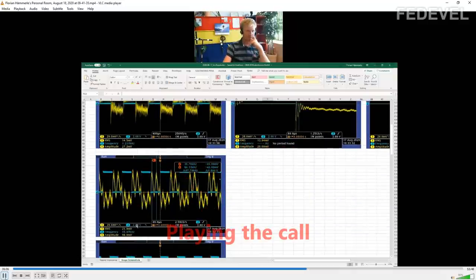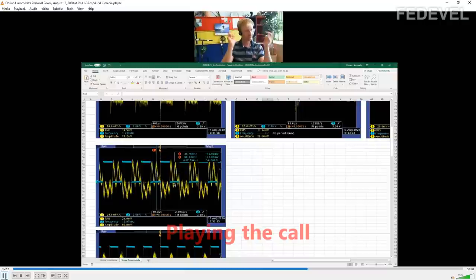Okay, and then as soon, of course, as we go into a higher frequency, we can make it trigger the oscillation more often, because it has not disappeared when it's triggered again. The damping did not have time to damp it out and it's triggered again and again and again. Then the noise is getting even higher. So here it's already 100 millivolts peak to peak.